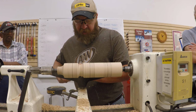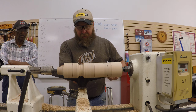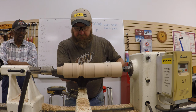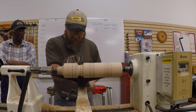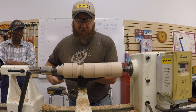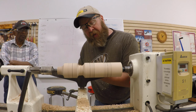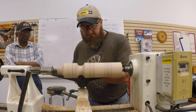And I'm going to work out to those lines. And notice how each time I start, the handle's getting a little bit higher and it's going a little bit farther away. So I'm going to get that nice sharp entry. Got my thumb rolled around behind. And you can just kind of feel it scoop and slide around that corner. It'll take you a minute to find it, but once you feel it, you know where you're going. Kind of at the bottom there.